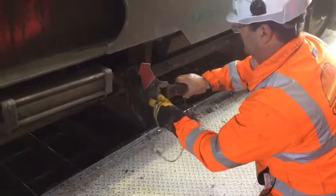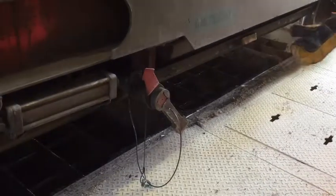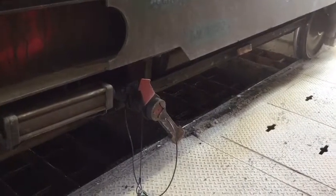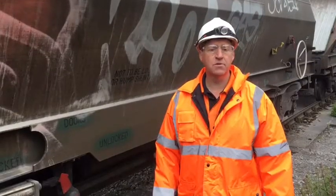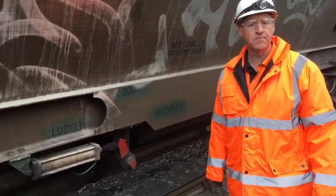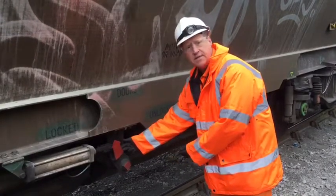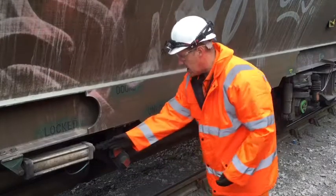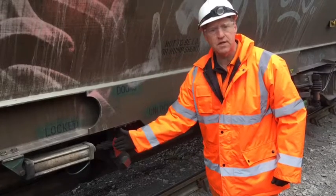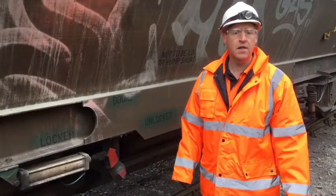The reason for the chain or wire on the flogging spanner is so that if for any reason it does happen to slip off, it doesn't go down the hole. Once the flogging spanner has been attached as shown, what we would advise is to feed the wire behind the arrow so as to come out of the nip zone. This nip zone is where the ram could activate and catch your fingers. Always feed it behind and come from a position of safety so you're no longer in the line of fire.